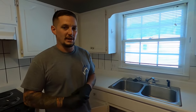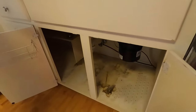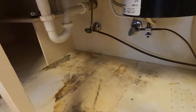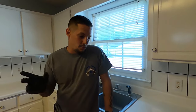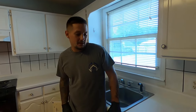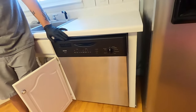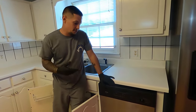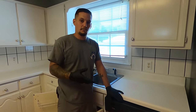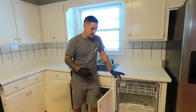Once you get all your faucets drained, now it's time to come back and run through the same process again — except this time you're going to be turning off all the valves to the supply lines for all of those faucets. Another thing that used to get missed — not as regularly now — was putting antifreeze in the dishwasher. So we've created a habit: as soon as we're around the dishwasher, we open it up wide so that when we're going back through putting the antifreeze in, it's easier to see and harder to miss.